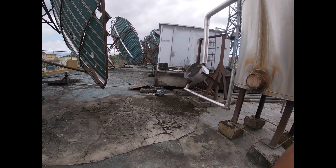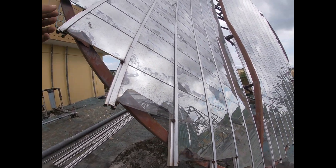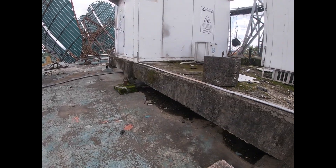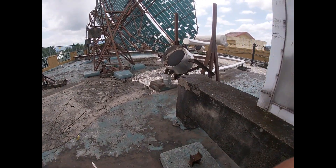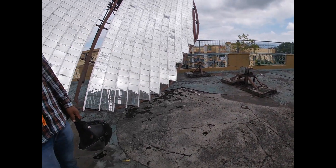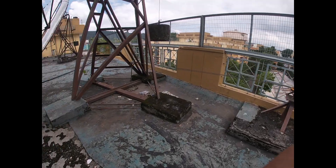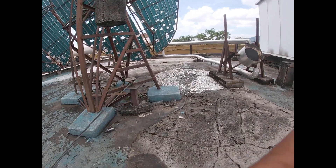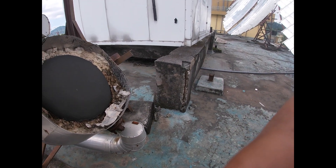The solar concentrator is made up of small square pieces of mirrors that act as reflectors. Combining all of them together, they reflect the light onto a black receiver. This black receiver is the focus point of the concentrator — it focuses all the sunlight on that one point. All the mirrors are operated together, and when the sun moves, a sun tracker system follows it. You can also see another black receiver on the tower where all the sunlight is focused, with cold water circulated through it.